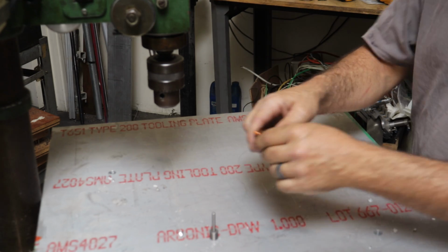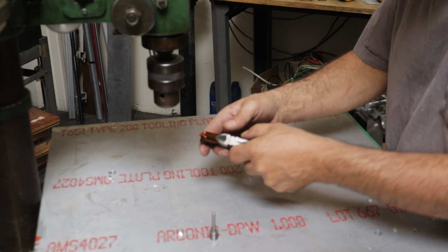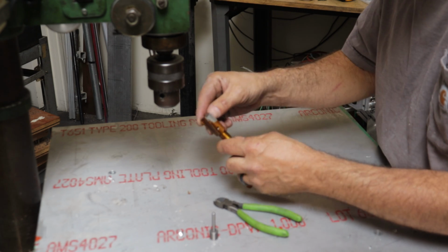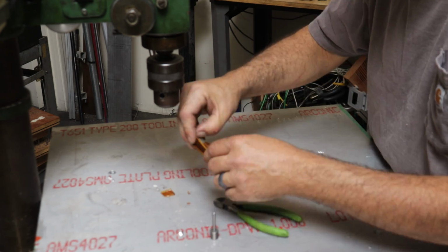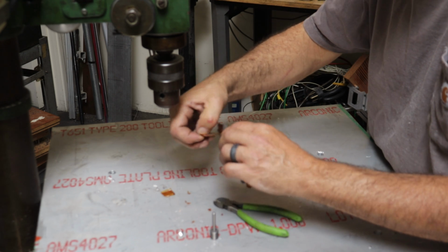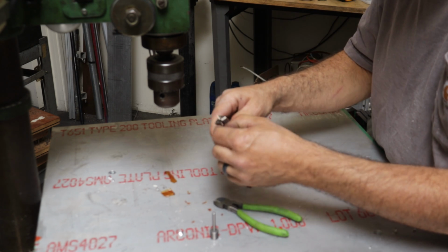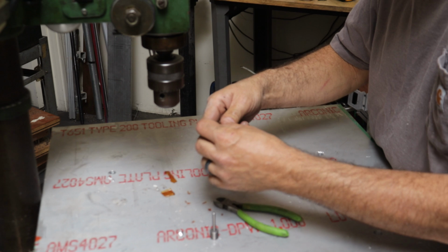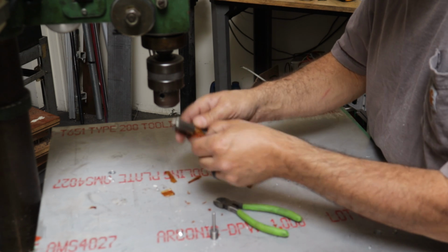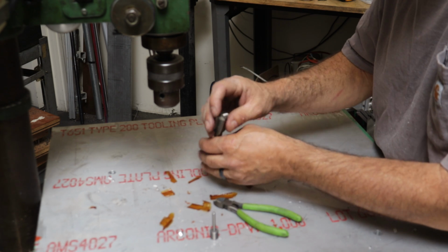All right, I just bought this morning for our countersink. We get this Cosmoline or whatever it is off. And this is kind of like an annular cutter with a hole in the middle for a guide post. And the guide post is slightly smaller than a 1/2 inch, so that we can use this drill press to make a countersink without it chattering like we did with that drill that was spinning too fast.